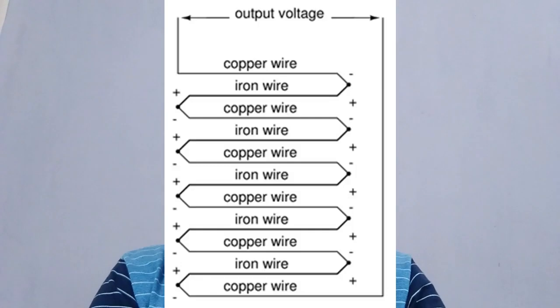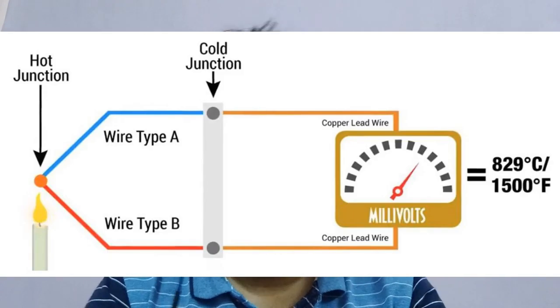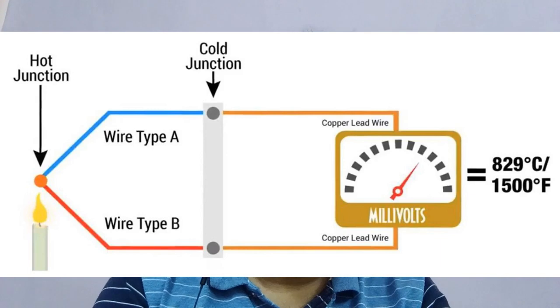When a laser or light hits a surface and the surface absorbs that light, it gets heated up. What this thermopile sensor does is detect what is the change in temperature of that surface. A thermopile sensor is actually a collection of thermocouples. A thermocouple is two different metals which are joined, and when there is a hot end and a cold end, a small amount of voltage is generated. So a collection of thermocouples is called a thermopile.